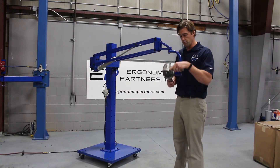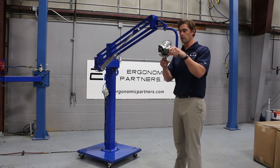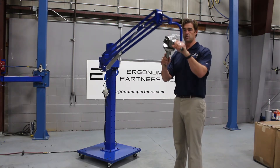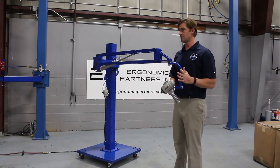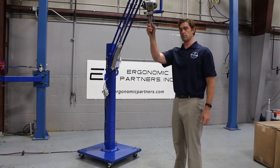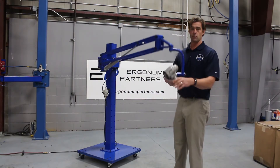You also have movement this way with bearings right here. This mounting gave you all the freedom of movement you need to do the long stroke grinding they intend to do. This unit itself has 50 inches of vertical travel — you can go from high all the way down to low, obviously with very little force.